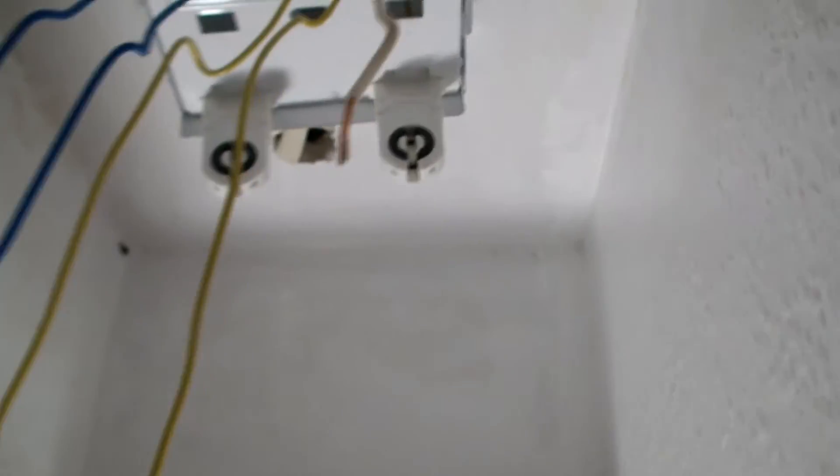Let's talk about the subject of shunted sockets. Whenever you buy these things, they talk about shunted sockets and want you to buy shunted sockets. I've done a lot of these and I've never had a shunted socket. One thing you know is that there's two wires going to each end, which means there's two separate wires — and wires cost money; they don't run two of them for no reason. Your standard ballast just does not have the shunted sockets or shunted tombstones, so you don't need them. I even took an ohmmeter and measured blue to blue and yellow to yellow, and there's no continuity — so these are definitely not shunted. The contact on this side is one side and the contact on the other side is the other side, and that's where we're going to wire up the line.